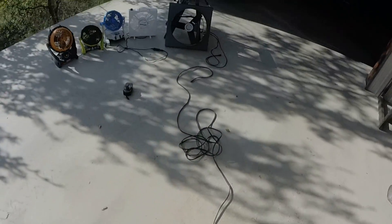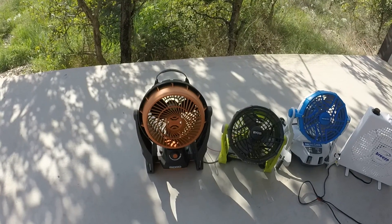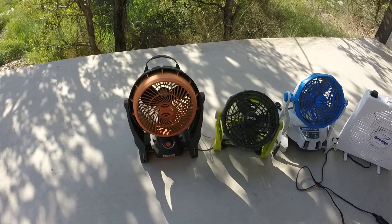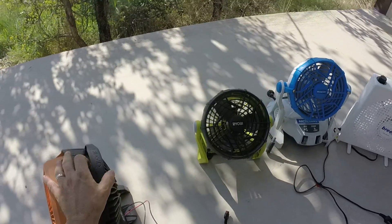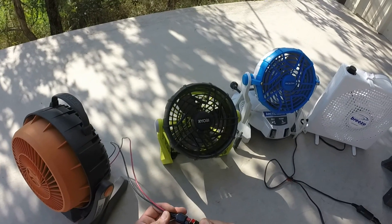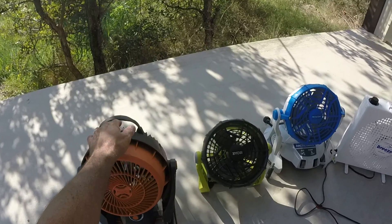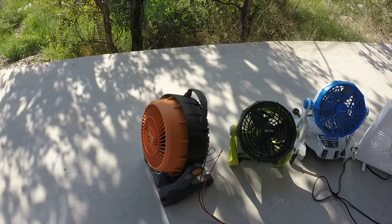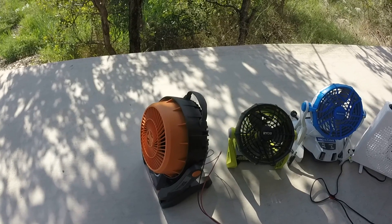The cord goes back over to this end here. What started this was I was trying to cool some equipment — an inverter, whatever. So I had this rigid fan because I have some rigid tools, and I thought I'd just wire that in and see how it works off solar. It worked, but the problem was when the panel was shaded it would stop working, and when it received sun again it wouldn't start back up. Sometimes the blade would just be fluttering, so it really wasn't reliable.